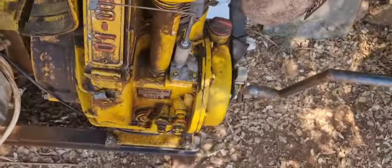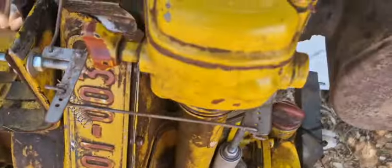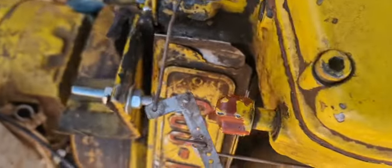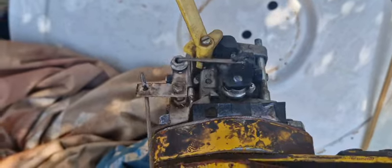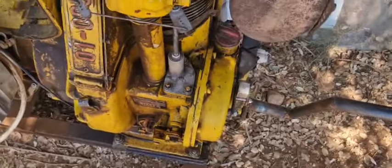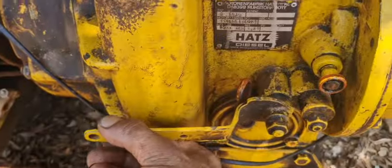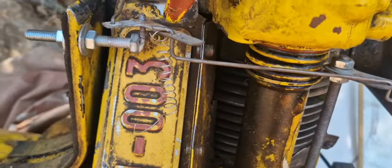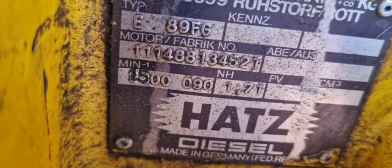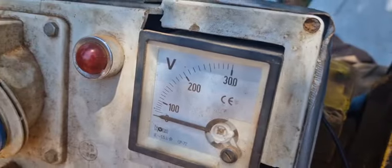Let's put the governor. Oh yeah, about the governor. How it works now: when you put it in low, it's right angles, and ends up perfectly, and when it hits this carved out tube there, that's the 1500 RPM limiter. I've seen if you throw the other way around, if I do it down, it also engages it. And that's engaging the regulator, because there's a stamped in thing here, 1500. That's the regulated part. Originally it seems to be a 2500 RPM engine. So you can run it in this stage, I think, higher than 1500, but who wants that? As we have already a nice generator.